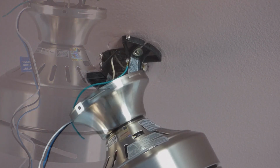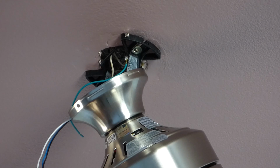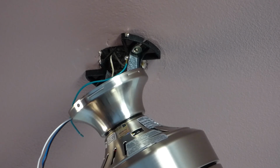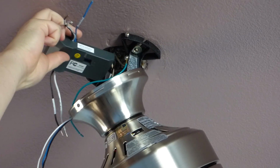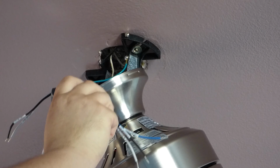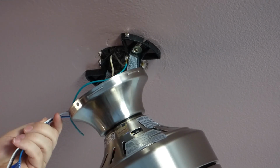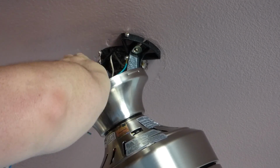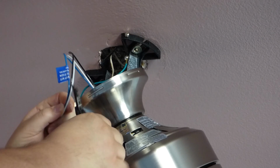All right, so in position here, and I will start by taking this thing here up to the top. Now this area is mounted with the flat side here up against the ceiling. And actually it goes right in this box. But before I put it in the box, I want to do a few little wire connections first. So first thing to go will be all this wire hanging down. That means this much wire. We'll go about 8 inches out and cut them off.